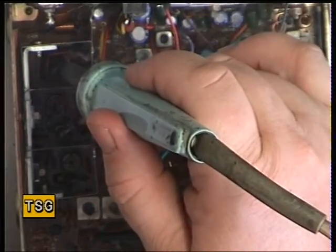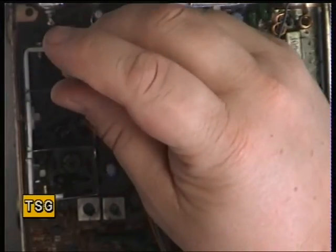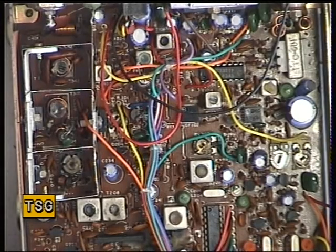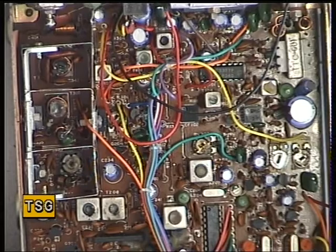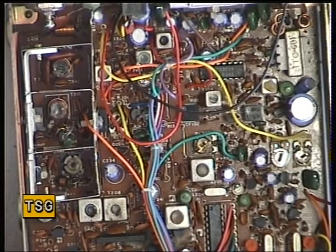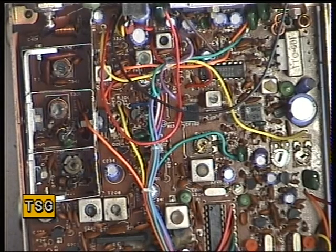As I've said many times before, the test set I'm using is a commercial professional two-way radio one, so what are real watts on here can differ greatly from what I would call good buddy watts. So this is 3.6 watts — that's how it is. The power supply has just crept up a fraction — yes, 3.6 watts. It's always going to differ from sample to sample. This probably equates to about 7 good buddy watts, but it's doing 3.6.